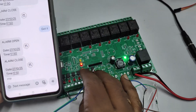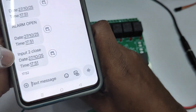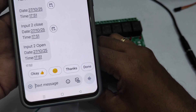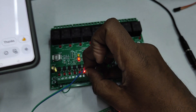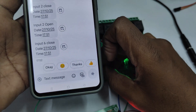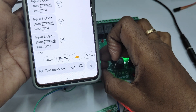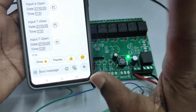You can change messages for all 7 inputs this way — up to 7 custom messages. Now testing the other inputs: removing the trigger from IN1 and looping to IN2, IN3, and so on gives the factory default messages for those inputs since they haven't been changed. Triggering IN2 gives 'IN2 close/open,' and triggering IN6 gives 'IN6 close' and when released 'IN6 open.'